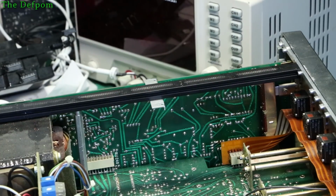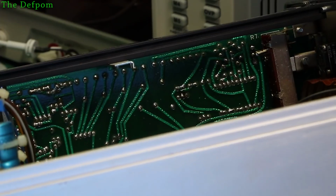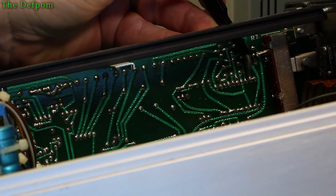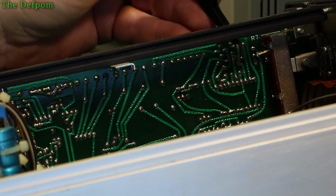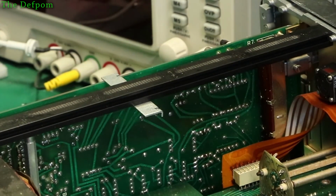So what's that going to? Goes to a resistor, which is in parallel with another resistor, so it's also a voltage divider. I'll point to that. You'll see there, so that's the resistor there comes up to. And then it jumps over to here, which is another resistor, which goes back down to there, which comes up here, and also comes up there too. So there's two traces we have to try and follow.